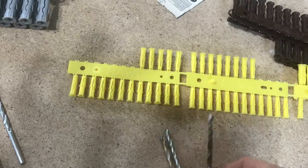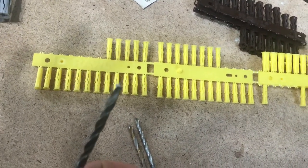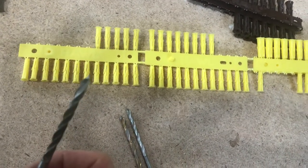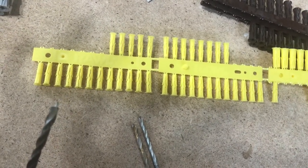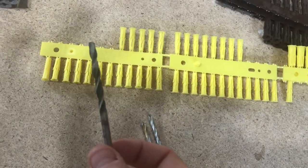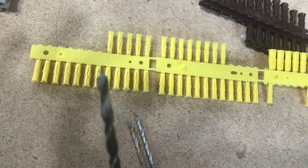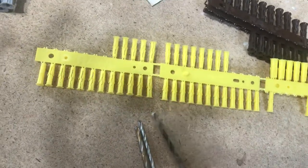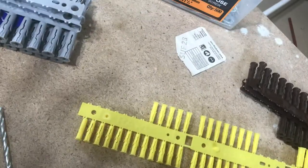Let's say you test your drill bit size. Obviously for drilling into wood, you're unlikely to need a rawl plug, but there are occasions — for example, if you're putting a hook to hang your dressing gown on an internal door, they tend to be made of very thin cardboard and ply, so you could put a rawl plug in an internal door. You'd also want to use a wood drill bit if going into plasterboard. These aren't the best for plasterboard but they do work. Universal does everything, masonry does masonry.